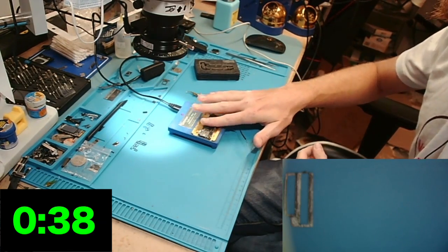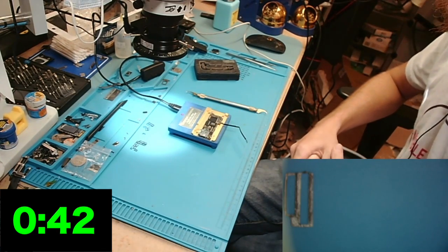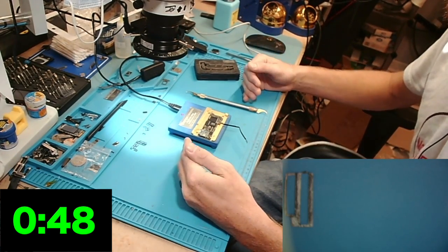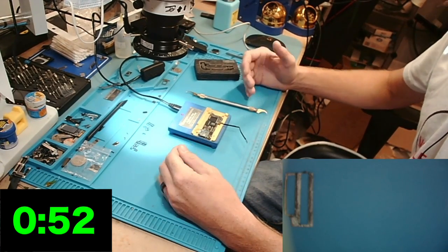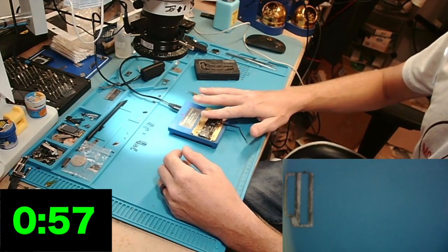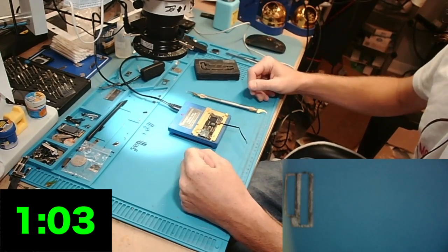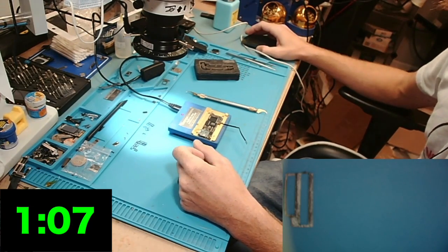First, we're going to wait for the board to get completely hot, okay? And this is a process. You don't want to keep the board sitting on the heater because you have a very limited time between ready to separate and damaged iPhone, all right? So you want to be very careful of that. And again, you'll see I'll probably speed up this part of the video until we're at the point of removal, just so you guys can see how long it takes. I'll put a countdown timer on how long I had to leave it on the heater for, all right? So we'll just wait for that.